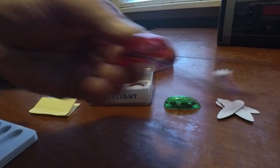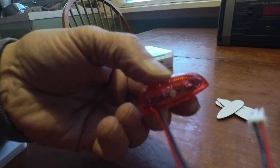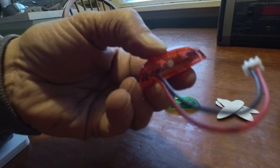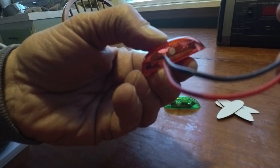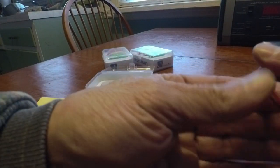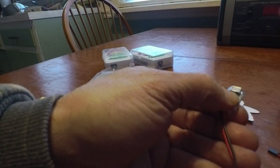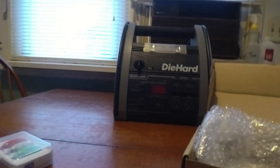You put the black wire in there like that — toward the button — and now you have proper polarity. If you hook this up to another power source out in the field, or you're using it for your tester, you'll get your battery voltage. To charge the unit it's the same way — watch your polarity, minus towards the middle — and then this plugs into a power source.